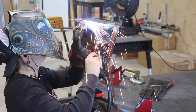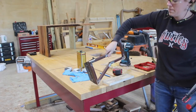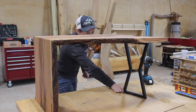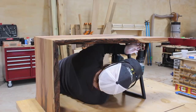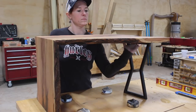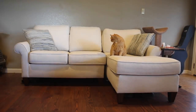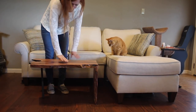I drilled three holes across the length of the flat iron on a scrap piece of wood at my workbench. At this point the first coat of wipe-on poly was dry on the table so I sanded it all down using 320 grit sandpaper and prepped it for the second coat. I couldn't resist attaching the leg first just to see how it looked, using those three hole locations to attach it to the bottom side of the slab. In total I did three coats of finish for this table. I made this small coffee table for a chaise lounge, but you can do the same process for any table.